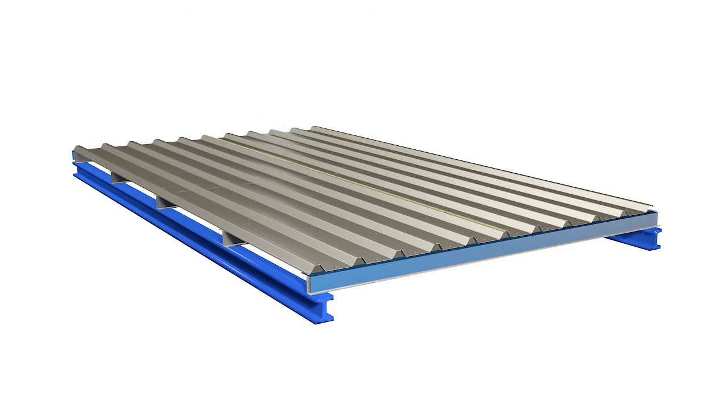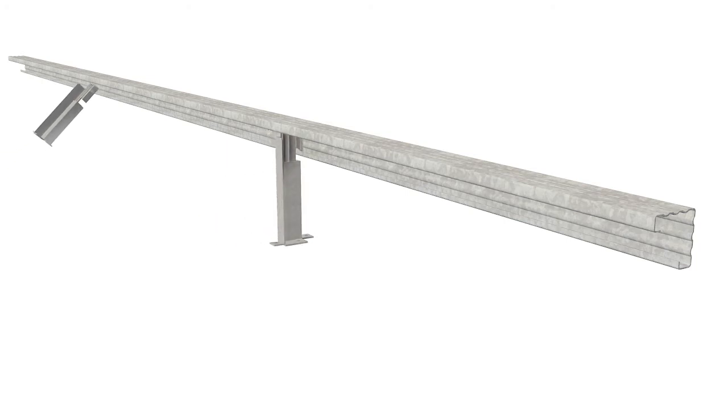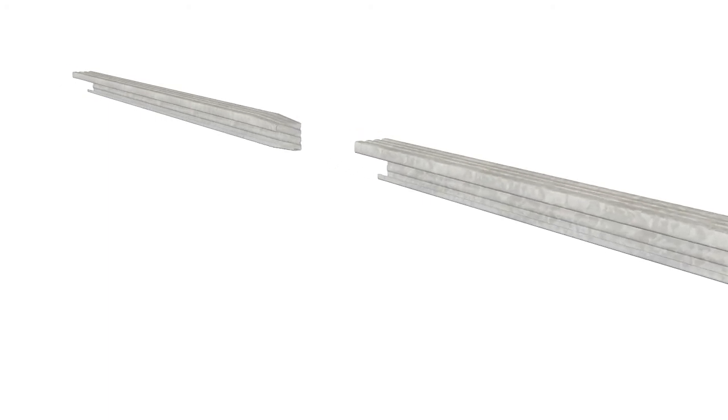The install lock plus spacer system should also be installed during the liner sequence. The brackets can be pre-positioned by twisting the brackets over the small hook, which starts to slide under the edge of the bar. With a slight push on the base then a twist, you'll feel a distinct click as the bracket slots into place. The end of the bar incorporates a 40mm spigot end for easy on-site connection to form a continuous level support.